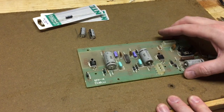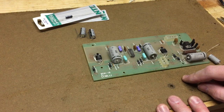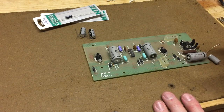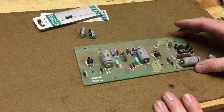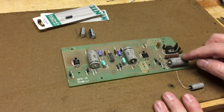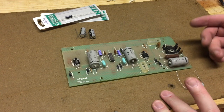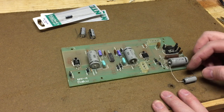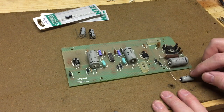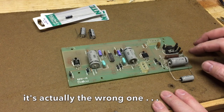I started by removing the power supply circuit board from this fiber board here. I think I'm going to use this later on — there was supposed to have been some fiber board at the keyboard of a slightly smaller shape, so I'm probably going to cut this to match what it was supposed to have been. We're going to replace these electrolytic capacitors. There's essentially an insulating liquid in these embedded in the paper rolls. After a few decades it evaporates, the capacitance goes down, they don't work as well. So this thing is four decades old — we need to replace these. Notice that the new one is a lot smaller than the old one; you can just attribute that to progress in the industry.